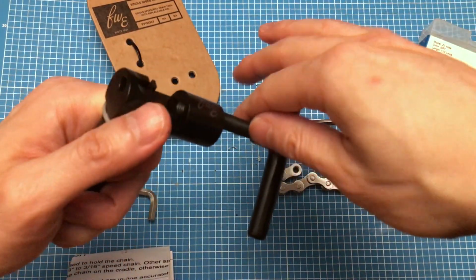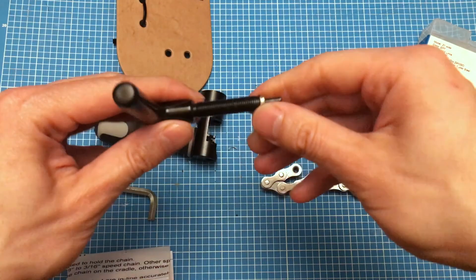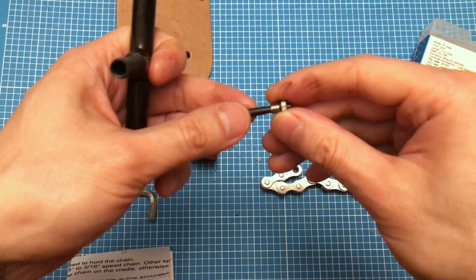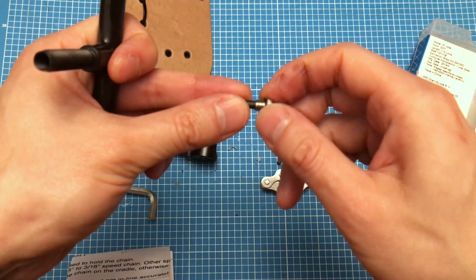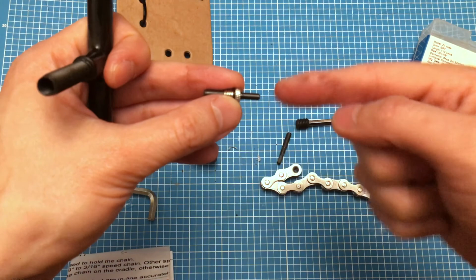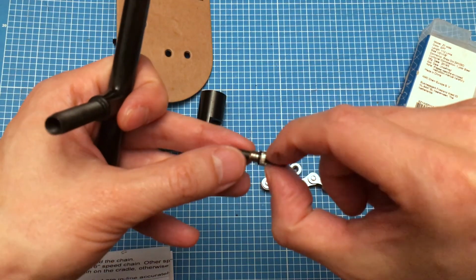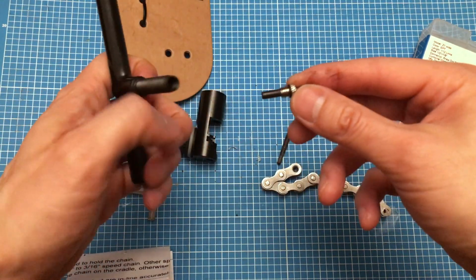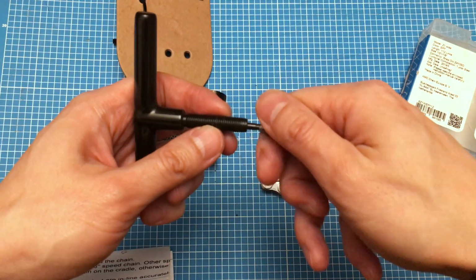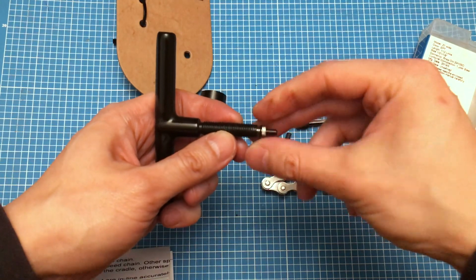So there are interesting features about these as well. This thing, the pin itself, oh, it's reverse, sorry, it's reverse thread. So here it is. And this thing is not locked onto this at all, so this allows a bit of rotation. When you spin it towards that pin, it won't be rotating into it, because that would cause tension right here, and it would also break the pin. Some of them go as far as having a ball bearing here as well. So this is what holds it together. See, it's just that, and this would spin freely in case there's friction. Yeah, reverse thread.